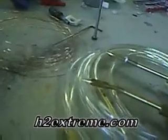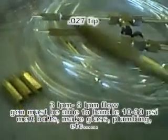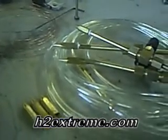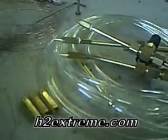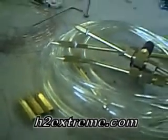I would recommend at least five liters a minute to go any bigger than that, and that's where the 027 tip comes in. The 027 tip is what we have on my torch, so I'm going to show you a demo. With that tip, you can go up to about eight liters a minute and melt through some pretty thick stuff. We're going to show you a quarter-inch bolt with that tip.